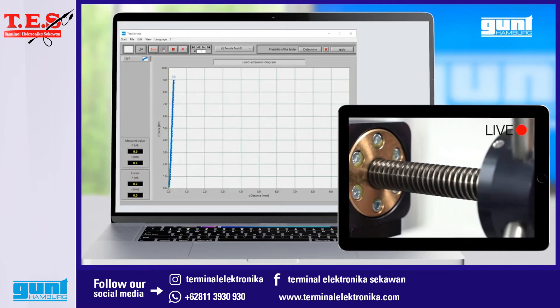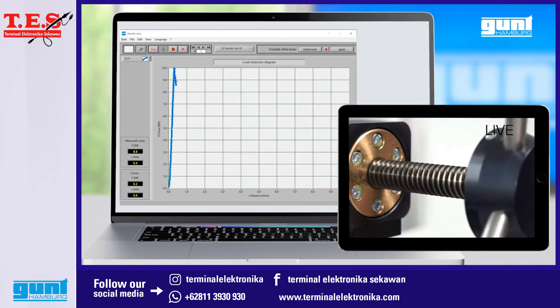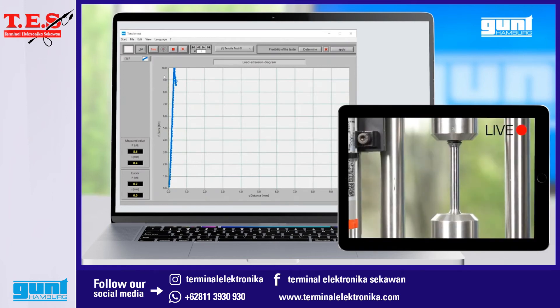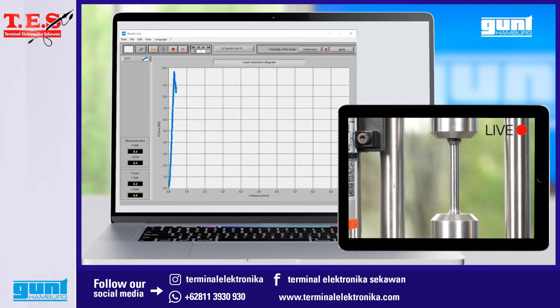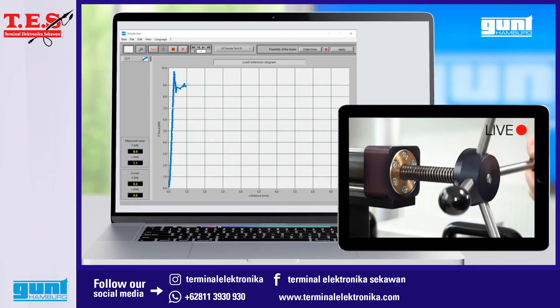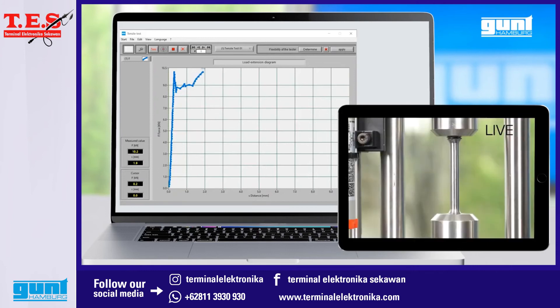Now you can see that we are traveling along Hooke's line quite nicely until we reach the proportional limit at the end of the elastic area. From now on the specimen will be permanently deformed. One of the neat features of the Gunt data acquisition software is that when the test force increases and approaches the upper limit of the screen, we can right-click anywhere in the graph area and select Auto Scaling for the vertical force axis. It is recommended to turn the handle slowly and evenly for the best results.